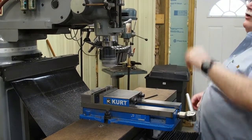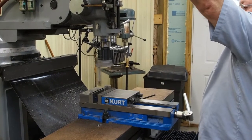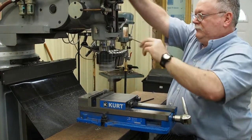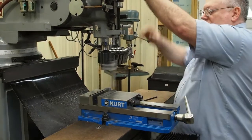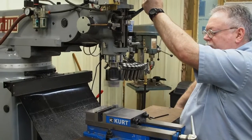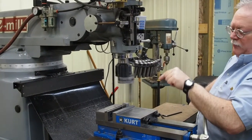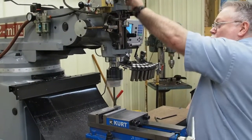You want to turn in reverse, and you can come down — you're not cutting. Just move in until you hear it. We will not be adjusting the boring bar itself. Right now we will just be using the X-axis and we will walk this in.